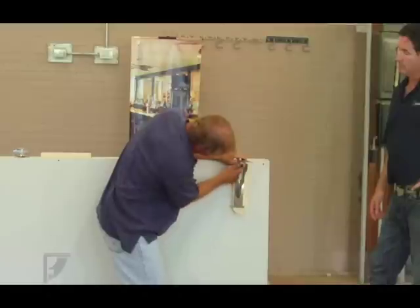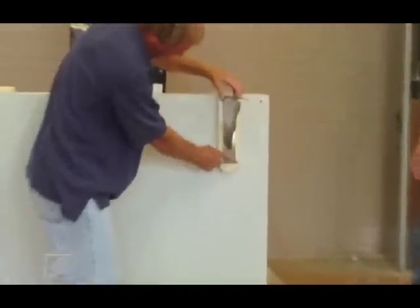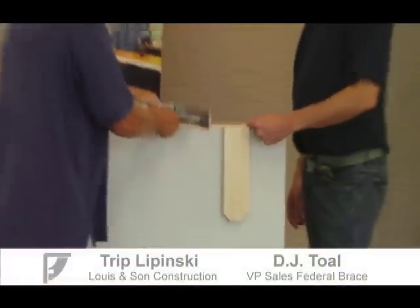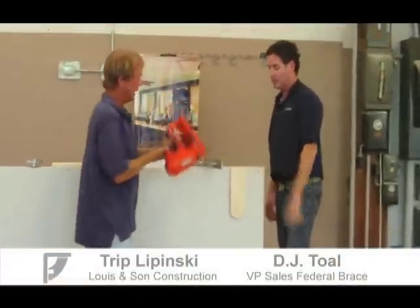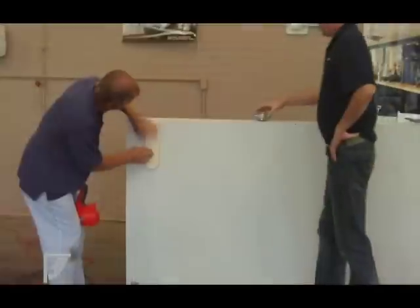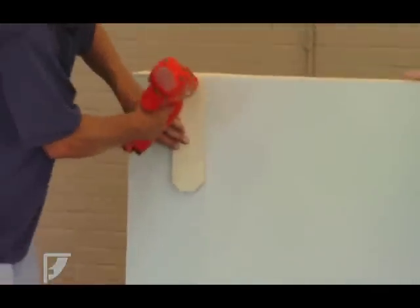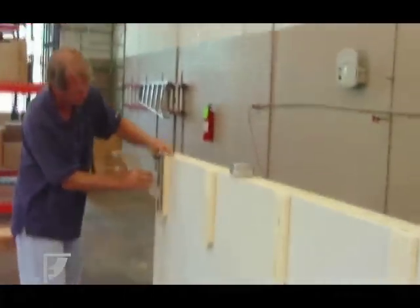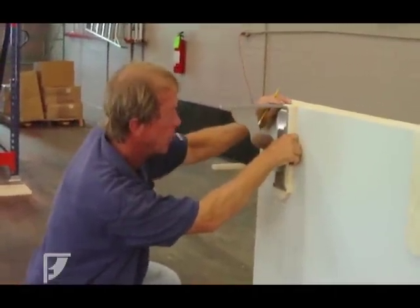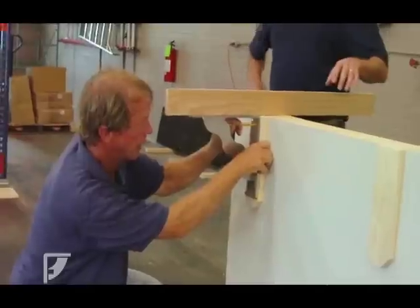You don't want to put the nails where the brackets are going to go — don't put nails back where you'll be drilling the holes for the bracket screws. Those are two-and-a-half inch nails going all the way through the sheetrock and into the block. Once again, flush with the top. Now we're going to take the bracket — it's going to center up over the block, flush with the top. Put that backing board on to make sure it's right and mark your pilot holes.